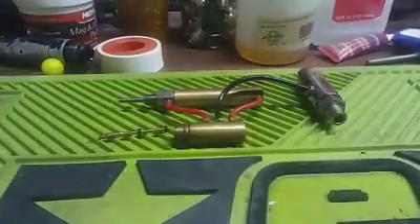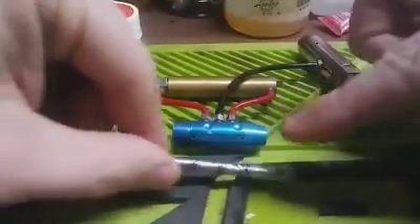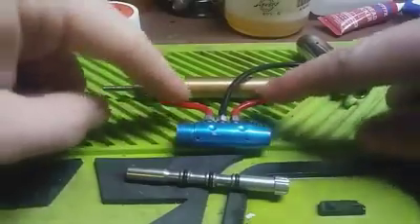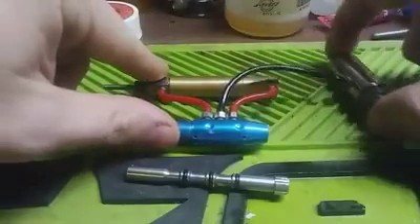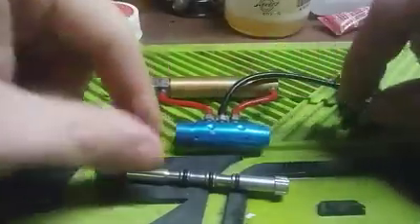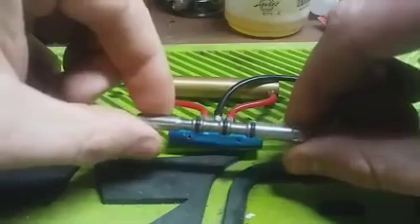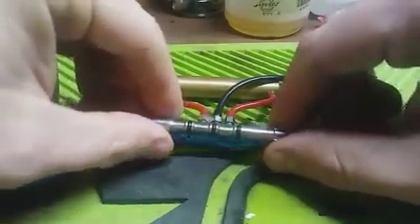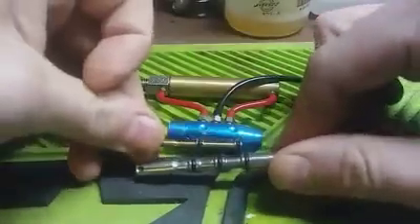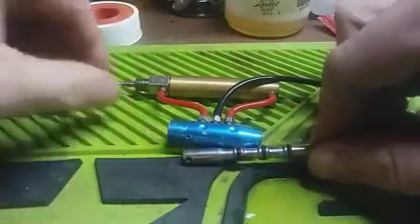So that's the basics of how it works with this kind of three-way. Now we've swapped out our three-way — this is a System X three-way. We still have the same connections going on back here, we still have our low pressure regulator feeding air into the center barb on our three-way valve. We wanted to take a look at what's different between a standard 2k WGP and something like this — you have two o-rings on the shaft versus three o-rings on the shaft.